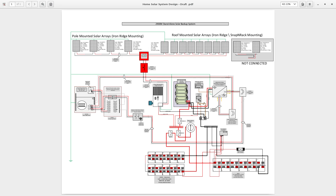This breaker feeds power through another 30-amp breaker to energize those two branches. If I have a power outage and power coming from the generator, it will energize these two circuits and back-feed into the main panel through this link and through the 30-amp breaker here, providing 240 volts input to my inverter, which then charges my battery bank.